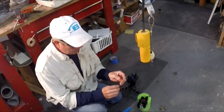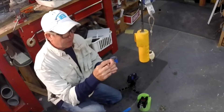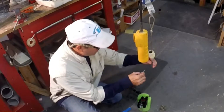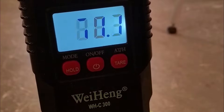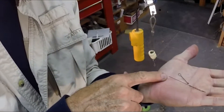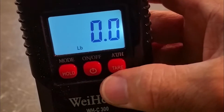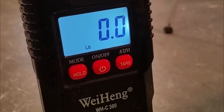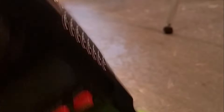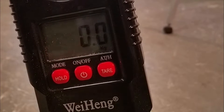Now that I know it'll pull to the strength of the wire, I want to find out how many barrel twists is enough. I reduce it from six down to three barrels on this one. The top end is full — six haywire and six barrel — but the bottom is six haywire and three barrel twists. Three twists was enough to bring it to maximum load. Let's go to two. This is number nine wire with only two barrel twists on one end.